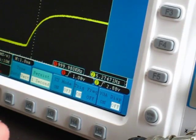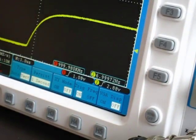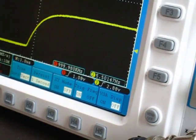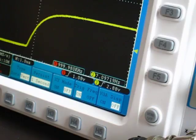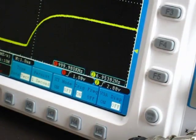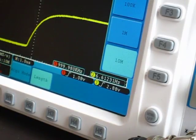You don't notice a massive difference in speed as you would really expect when you go from 1K to 10 meg capture depth. And I understand that was a design decision to make. It's a little bit of a shame. Personally, I think I probably would have decided to keep the Owon if they had made the waveform capture rate as fast as possible with the very low memory settings, the 1K or the 10K, maybe just 1K is fine for a fast waveform update, and then gone with the slower DSO qualities of capturing, only when using the higher memory settings.